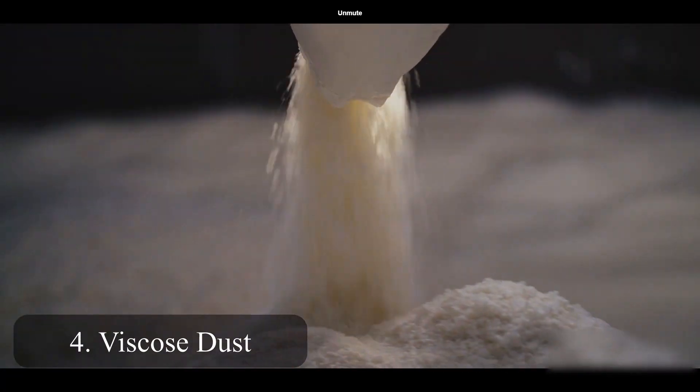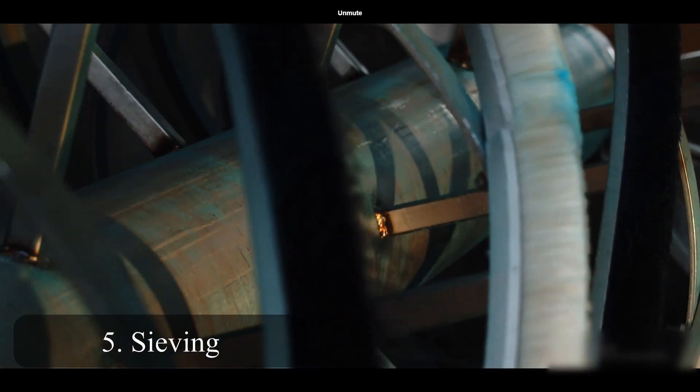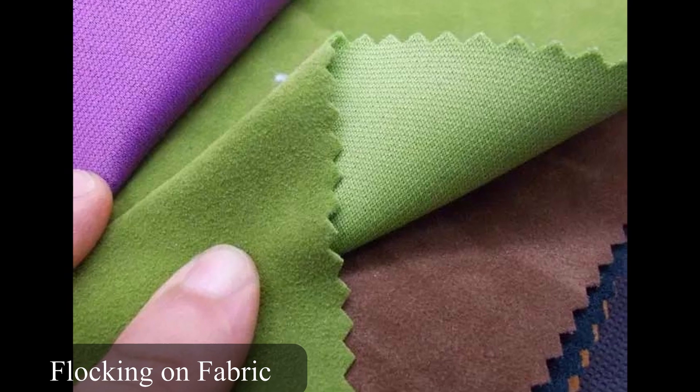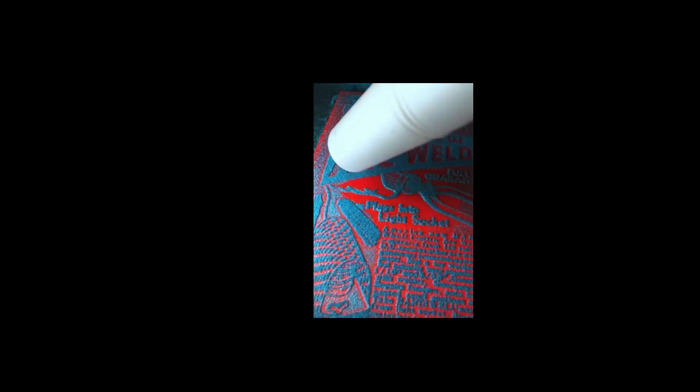The difference is this: flocks are blended fibers that are electrostatically charged and sieved. Sieving is essential in order to have a perfect homogeneous textile dust. Flocking can be performed on garments, fabrics or yarns. The process is basically the same — you need flocking fibers and electrostatic glues. If you perform flocking on yarns, you can perform weaving and the garment is ready. If you perform flocking on fabric or a garment, you need to print after the weaving process. This special printing technique is performed through rollers or screen printing, using electrostatic glue instead of inks and pastes.